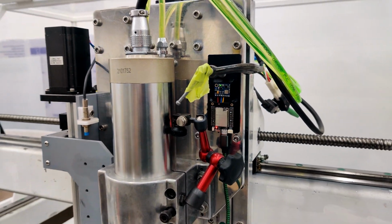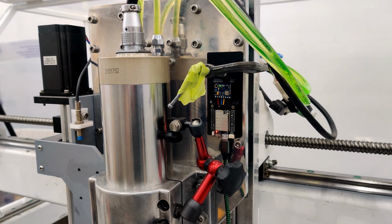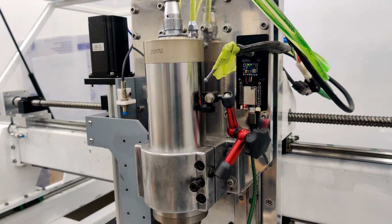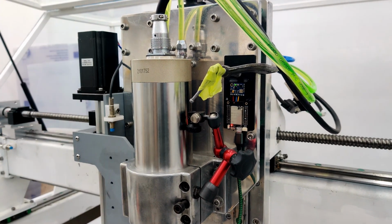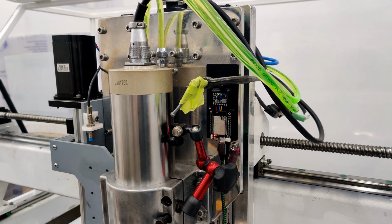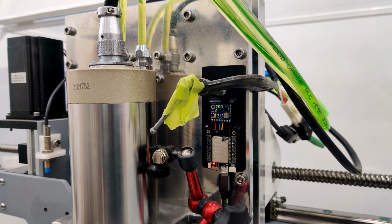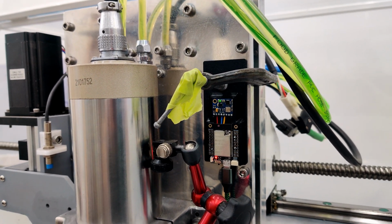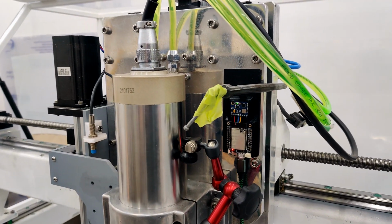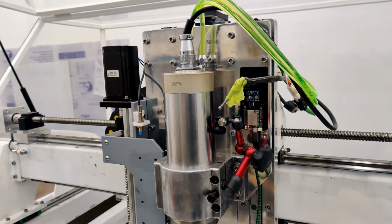And other than that, I'm going to reduce the stepping for the RPM. Right now it's at 25 RPM per step. I'm going to go down to 10 RPM, and also drop the time delay from 1 second to half a second to settle, because 10 RPM increments is basically nothing. The spindle's not going to need much time. I might also try doubling to 500 subsamples. Right now I'm doing 200, but 500 should give me a lot more freedom to work with, and it should clean up a lot better. So I'll try that. Reducing the delay from 1 second to half a second should make all the extra stepping quite negligible in terms of how long it takes to run.